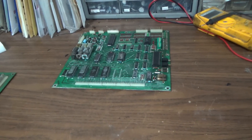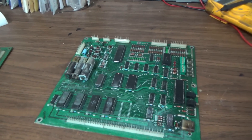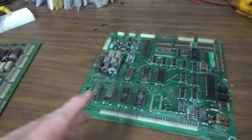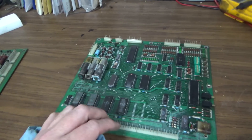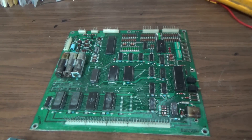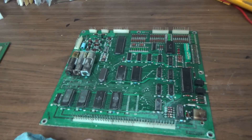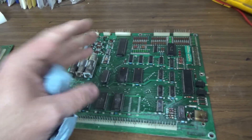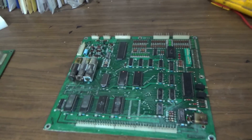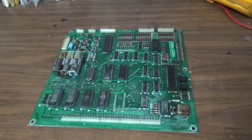So how do you test the MPU board without the driver board? If you're running the original program you can't — it needs the driver board to boot up. However, there was a gentleman named Mr. Leon, many years ago, who created a test ROM that you put in this game on the board, and basically it just tries to flash all of the PIAs. You can use that to test everything and tell if the MPU is any good. But first, we're going to have to clean up all of this alkaline damage.